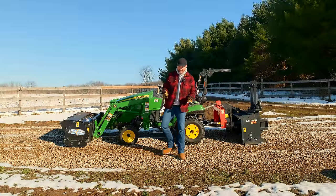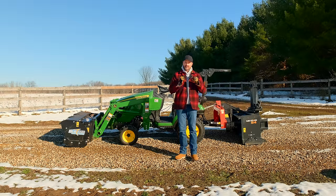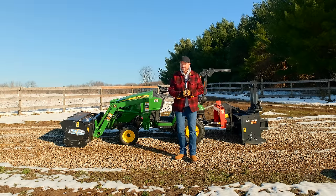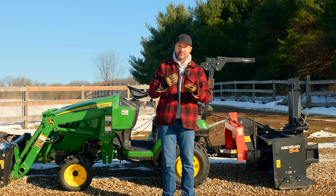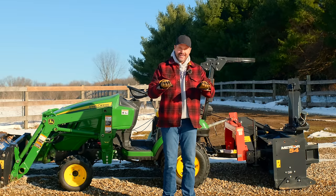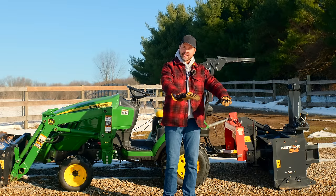One of the realities of having a gravel driveway is that you're just not going to get all of the snow off of there. A really common technique is to actually leave a skiff of snow on top. You do that naturally by having that cutting edge raised up a bit, and you want to let that get packed down and harden up — let it stay there all winter long if possible. It's going to act as a barrier that almost seals the gravel down underneath and keeps your cutting edge safe and above, which helps prevent major driveway renovation in the spring. If all you have is your bucket, you can still get your driveway done, but you want to make sure you have that front edge rocked back and curled up in the air. Keep that leading edge maybe an inch or two above the ground — same concept will help you pack down a base layer and get the majority of the snow out of the way.